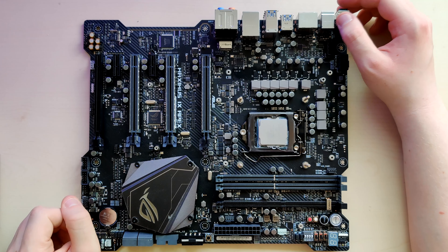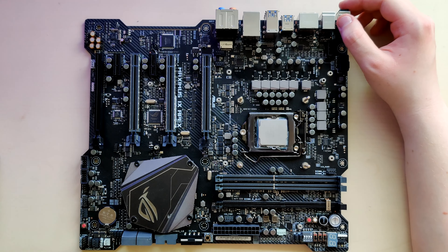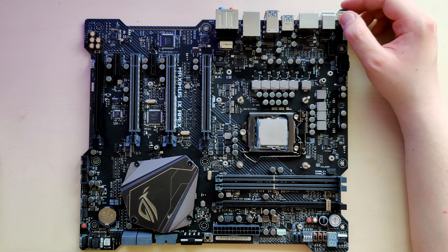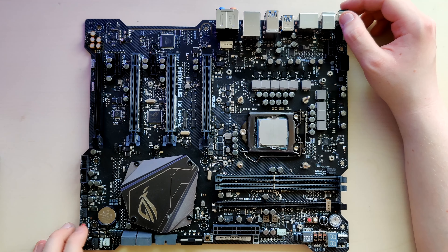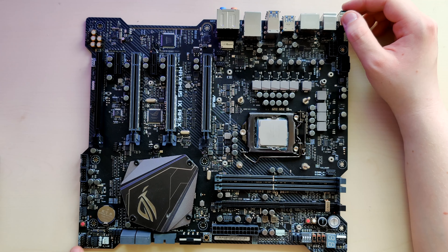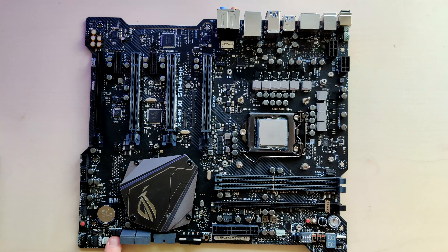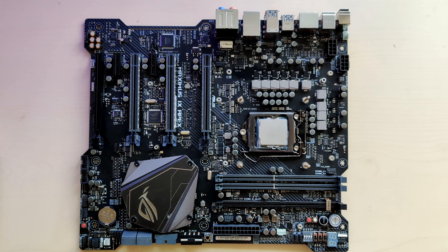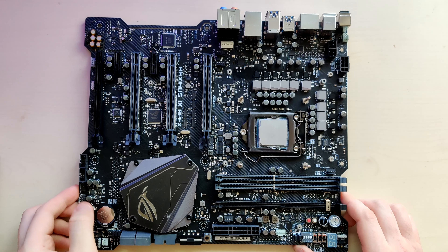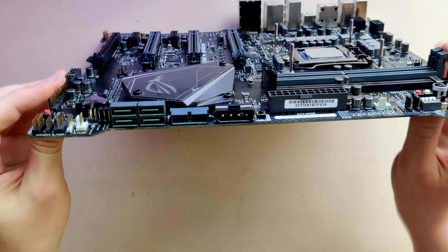Here we have a BIOS switch because the board has dual BIOS. Then we have some front I/O connectors, fan headers, and jumpers where you can turn on and off some of the RGB on the motherboard — if you just don't want RGB you set those jumpers to the other position and the RGB turns off. Then there are four SATA ports, a right-angle USB 3.0 header, and a Molex connector. The Molex works the same way as the 6-pin does on the Z170 SOC Force — it adds extra power to your PCIe slots, because the 24-pin only has two 12V cables, not great at carrying 300W for four-way Crossfire. Plugging in the Molex takes some load off the 24-pin.